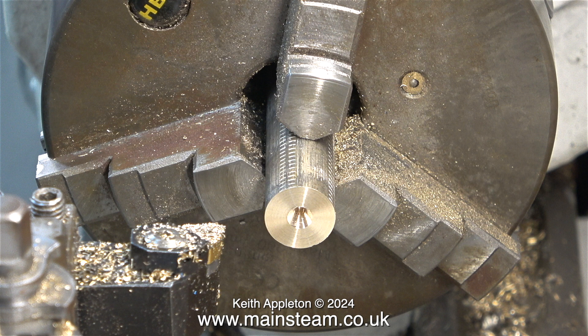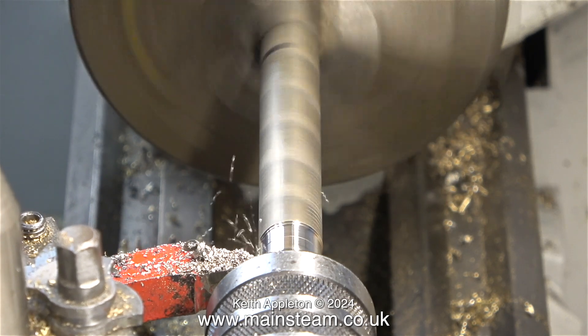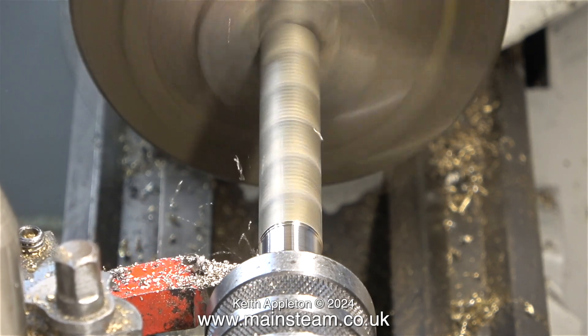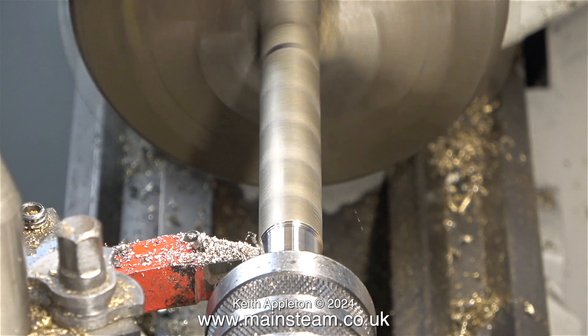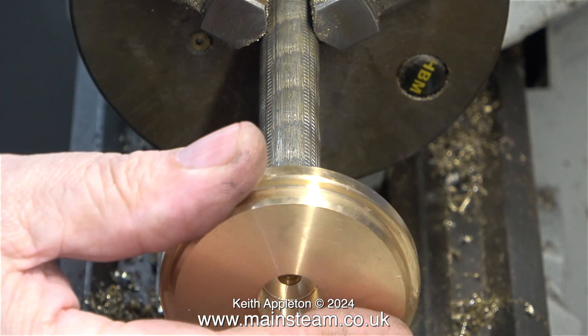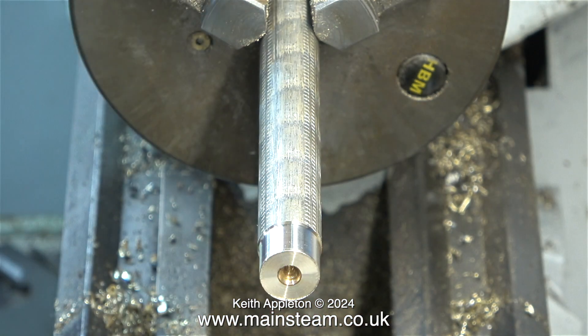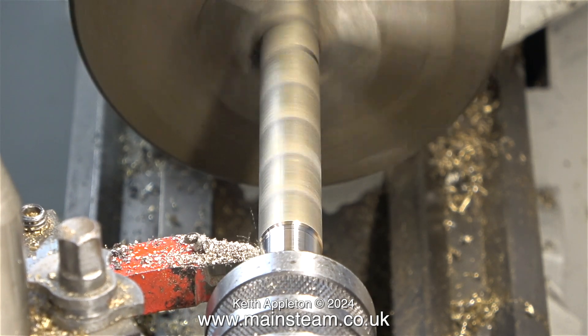Once I centre drilled the end I turned the piece of bar around in the chuck. This piece of Phosphor Bronze is easy to machine and it's also very strong, so I can turn it around in the chuck and hold it by the part that I need to cut off — the chucking piece. The first thing I need to do is reduce the overall diameter so it fits in the top cap and the piece that fits down inside the boiler tube. I'm using a round nose tool for this — it was a problem when I used it on cast iron but it's not a problem at all with this Phosphor Bronze. The tool is actually the wrong hand, but I use it because I can move the tool post out of the way and get a clearer shot with the camera.